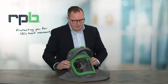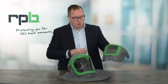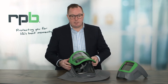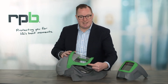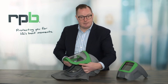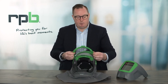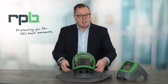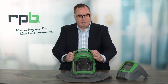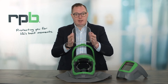To replace the grinding lens, I'm first going to remove the auto darken lens for ease of demonstration, and then pop the grinding visor open just a little. You'll notice there's a Z-Link logo at the bottom corner of the lens. Behind that logo is a clip that is holding the weld grinding visor together. By rotating that out, we'll separate the visor in two, giving you access to remove the grinding lens.